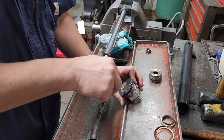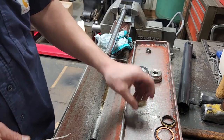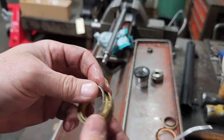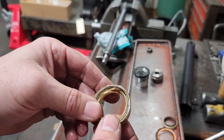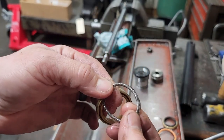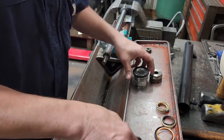That's the failure point. As you've noticed with a lot of these cylinders we reseal, this is the main seal that goes bad. This one actually has a metal spring in the bottom side, so this is similar to a loaded u-cup — it'll have an o-ring in this groove. When it's got something in the groove it's considered a loaded u-cup, and without it it's considered unloaded. This is basically holding low sealing pressure against the gland and the rod — just an added measure to aid in sealing.